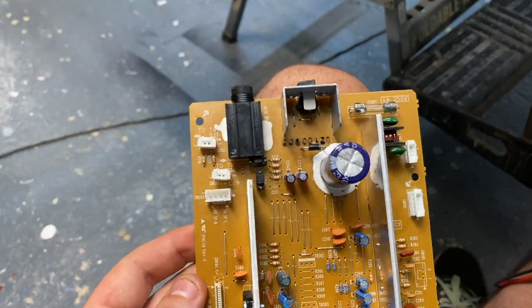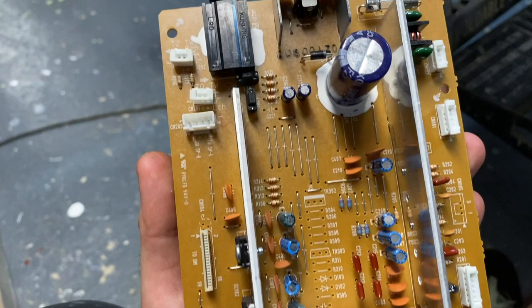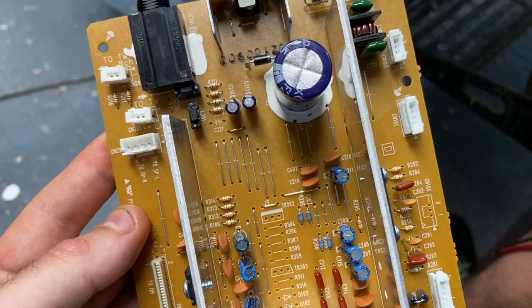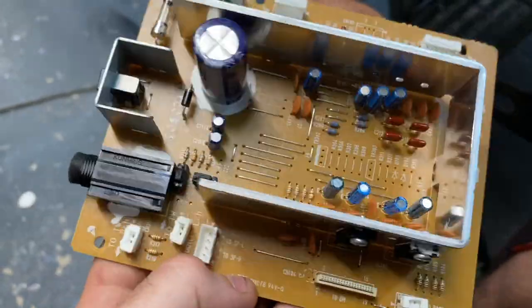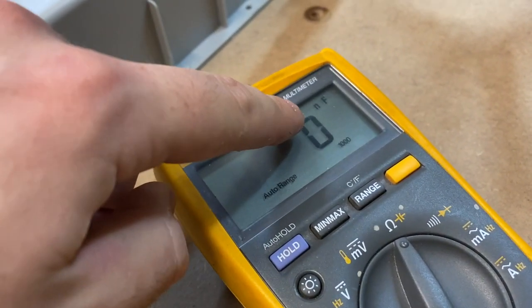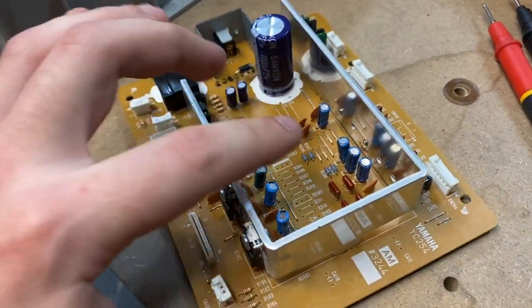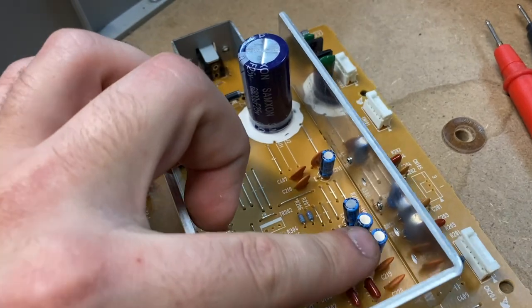Now I can't take credit for finding this — I've done a little bit of research. It's always worth doing as someone's probably been here before you already. What I found is that these two capacitors in particular — C207 — can be problematic. There's nothing obvious; none of these capacitors have blown out. If a capacitor is bad they usually pop at the top, but they all look fine. So I'm going to use my multimeter on the capacitance setting. It's measuring farads on auto range, and I'm just going to measure them while they're in the board.